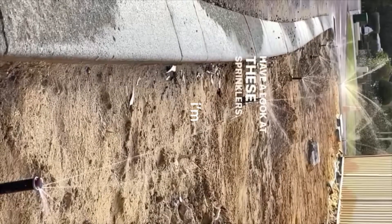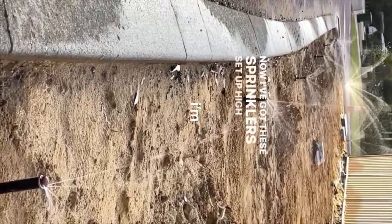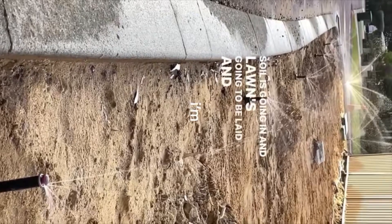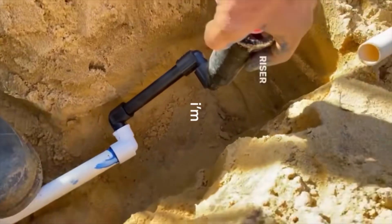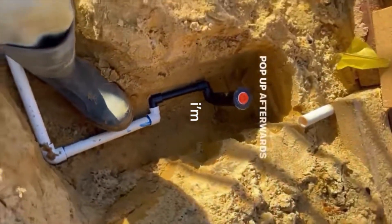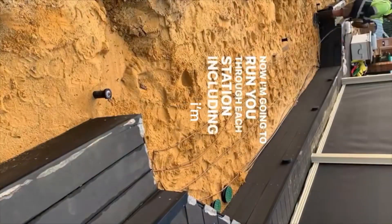Have a look at these sprinklers — each sprinkler is overlapping to the next. I've got these sprinklers set up high because 100mm of soil is going in and lawn is going to be laid. We can do this because I use a flexible fitting called an articulated riser that can manually adjust the height and angle of the pop-up afterwards to get it absolutely perfect.